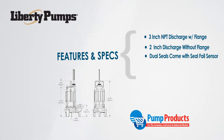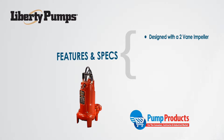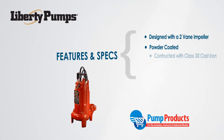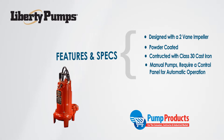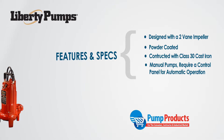These are dual seal pumps with built-in seal fail sensors. The motors have class F insulation and are rated for continuous duty use. The XLE is designed with a two-vane class 25 cast iron impeller, with bronze options available. These XLE pumps are powder coated and constructed from class 30 cast iron. They are manually operated and require the ISS series and ISD series intrinsically safe control panels for automatic operation in simplex and duplex systems respectively.